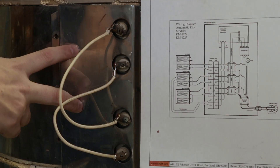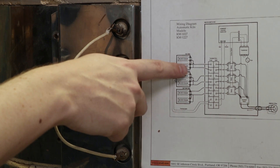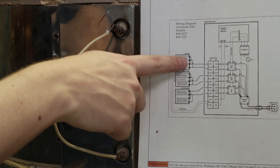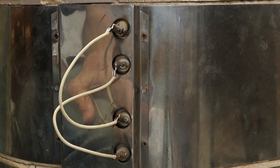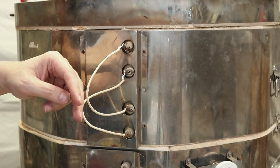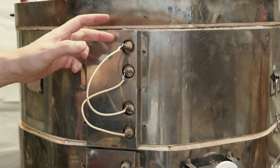This ring is now wired up just like the kiln diagram. The top element is jumpered to the bottom element — they're in parallel, which will then be fed by one of the relays. Next I need leads that go from the elements to the relays. Since I don't know exactly where I'm going to put the relays yet, I'm going to make these wires relatively long and trim them later.